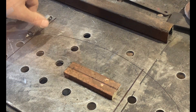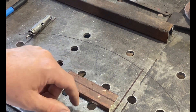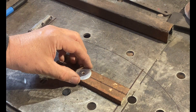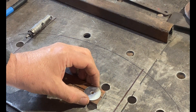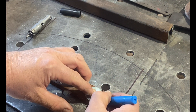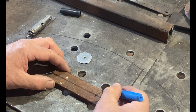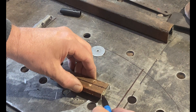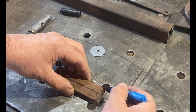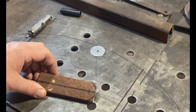Drill these using exactly the same technique as we've used for all of our drilling — it's thick steel, so pilot hole first, then your finishing holes at 13 millimeters and 16 millimeters. At our 16 millimeter hole end, we need to really round that off. I found a washer that was basically the width of my piece, put it right on the edge, and just marked around it — that gives you a nice guide. This end has to be really rounded off. The end where our tie rod bolt goes through can just be cleaned up and mildly rounded off, but at the end that comes through our traction loss bracket, we have to get that material off or it jags on the bracket when you try to put it through your hardwood timber bracket.